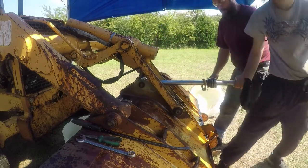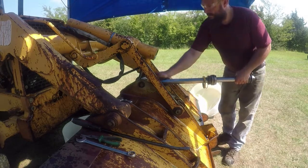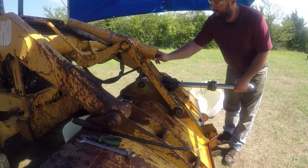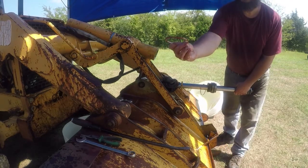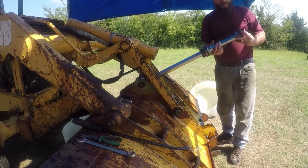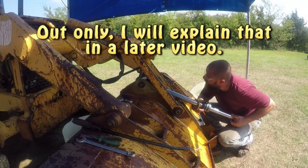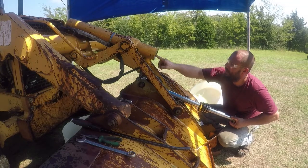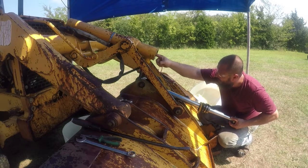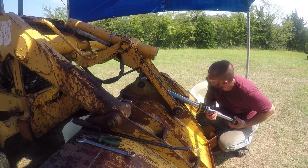Piece of wood I got here. This ring will get inside here and prevent damage to this when coming in and out. It's a good idea to inspect the inside sometime. If the machine is set for too long, moisture may get inside and it will damage the wall of the piston, and later on it will cause damage to the new packing. However, this looks real nice.